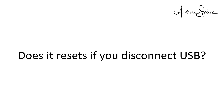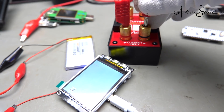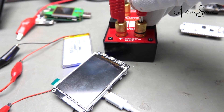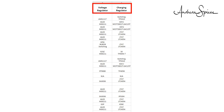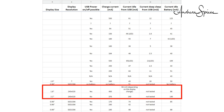The next criterion you do not find in the datasheets: does the board reset if you disconnect USB power? This is very important if you want to run your board on batteries and charge them occasionally with a solar panel — it is not good if your board always crashes when the sun comes out. As information, I provide the type of voltage regulator and LiPo management chips where I know them, and I want to thank the viewers who provided missing information after the last video. As the last step, I measured the current consumption of the entire board without anything connected and without Wi-Fi. As expected, bigger displays need more power. Battery values can differ from USB values and are usually more important as they directly influence the autonomy of your project.